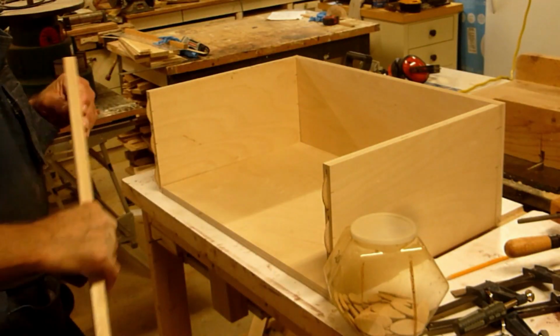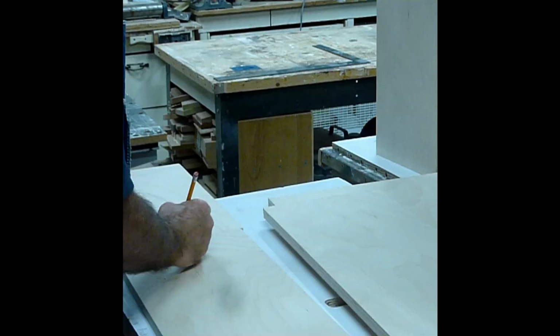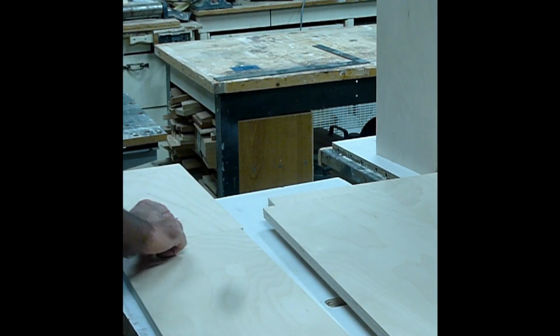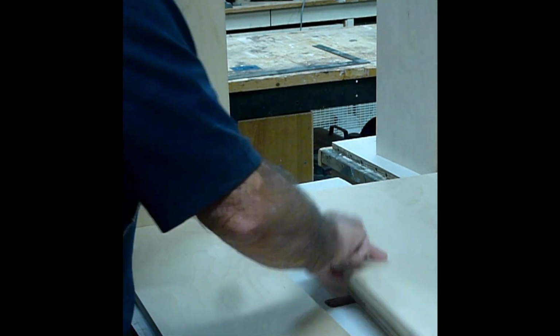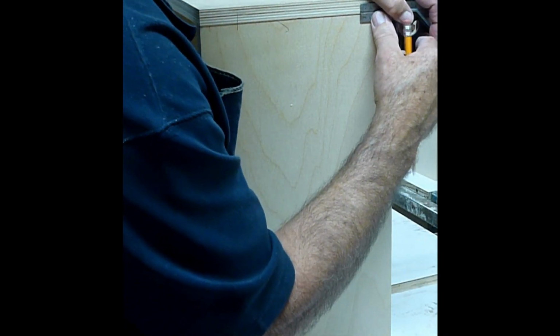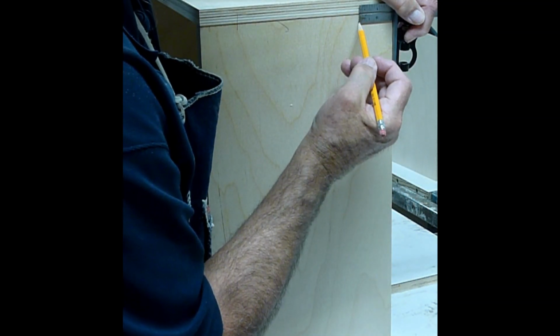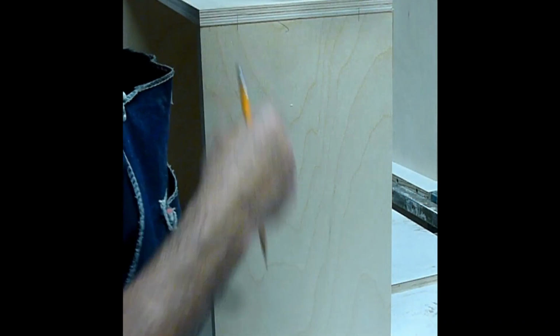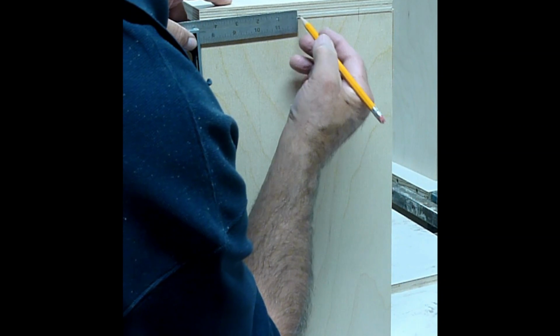Now since this is part of a furniture project, I'm going to use biscuits to avoid visible joints. Also, number your cuts on each side of each joint. Here I'm doing that with just a light pencil mark. Each joint should have its own identifying mark. This helps greatly when you try to match them up during glue up and assembly. We're marking our locations for our biscuits now. Be sure you mark both sides of each joint. I allowed 1 3/4 inches on each edge and center the middle biscuit. I will lay out all 4 corners of the drawer before I start cutting the slots.